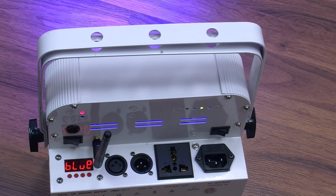So I hit enter again, and then it shows white or amber. Remember, with your fixture, it's either white or amber, it's not both. So you hit the button and say I want amber completely off, so again I hit 0. So that would be a custom color within this light fixture. And if you're doing a custom color, then you would have to do it with every single one, so remember the numbers that you use.